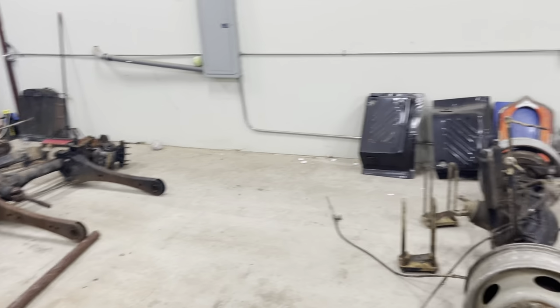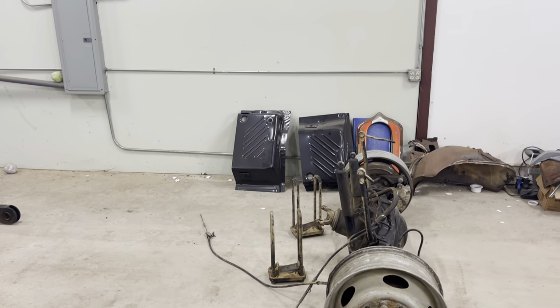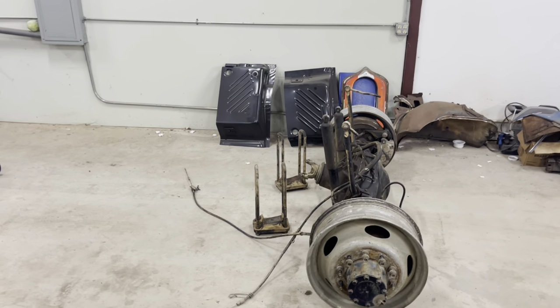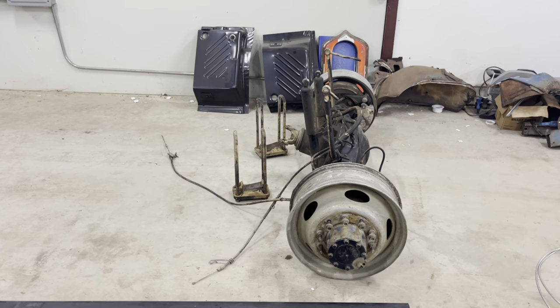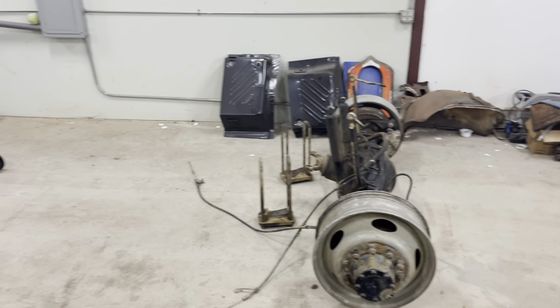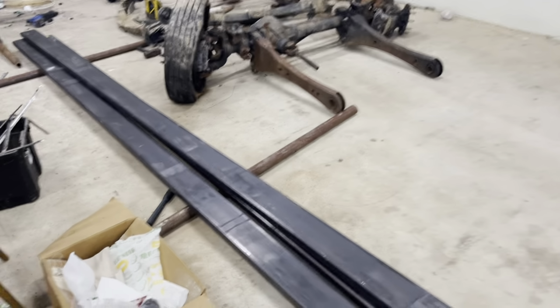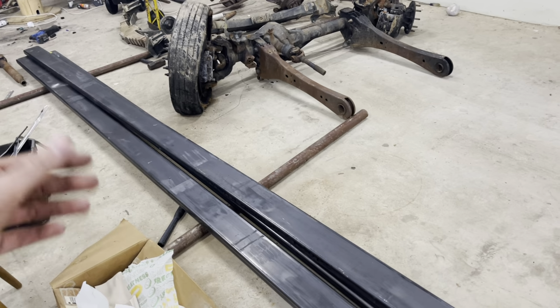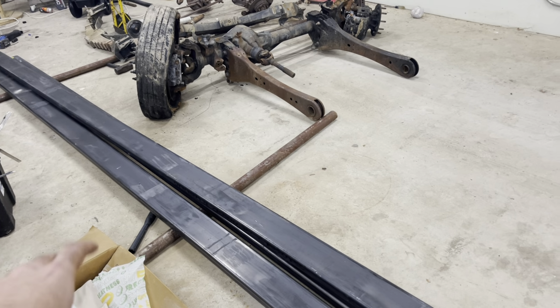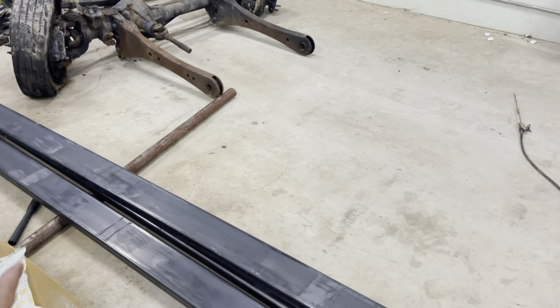It's from, well, I'll just tell you, the Diamond T pickup that we have, the 47, we're going to use these Super Duty axles. They're F550 axles. They're Spicer axles, S130s. They're way too big for that truck, honestly, but I wanted to build something I could pull anything with. And this is 2x6 square tubing, quarter inch wall. It weighs about 250 to 280 pounds of stick. It's heavy, and that's going to be our frame.